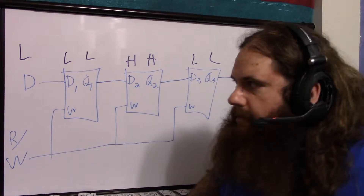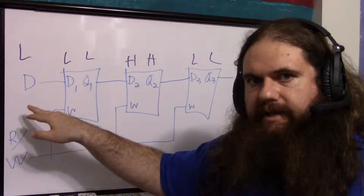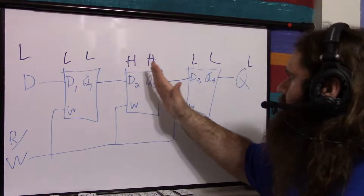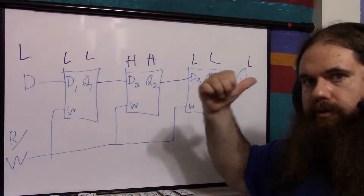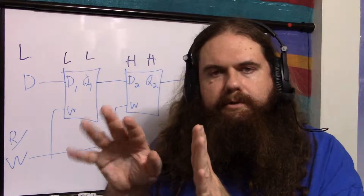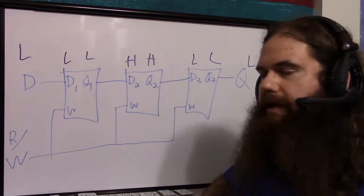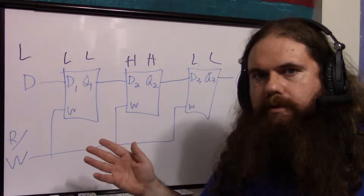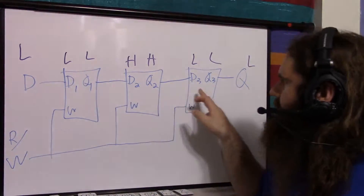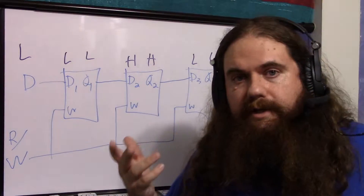So that's serial in — the write. You set whatever datum you want to put in, turn on the read-write signal, and D1 takes the input while D2 takes Q1, and so forth. The first flip-flop takes on the input value, everything else scoots over one, and whatever was at the end drops off and is gone — like a shelf of books where you push one in and eventually books fall off the other side. It's first in, first out — in Unix parlance, that would be a pipe.